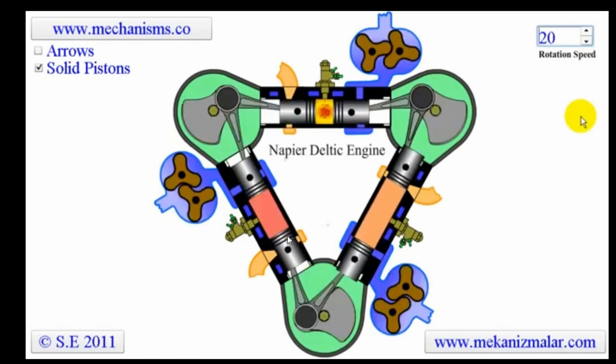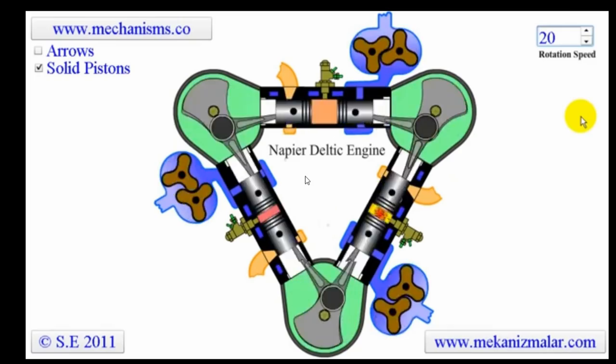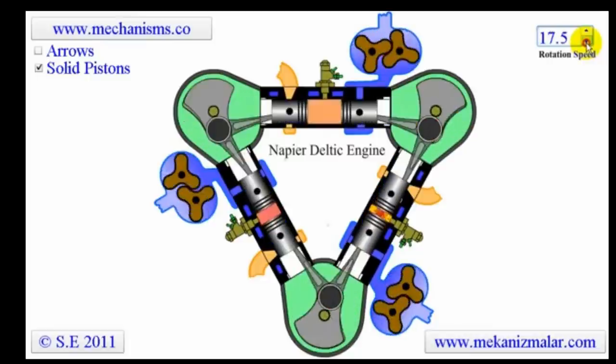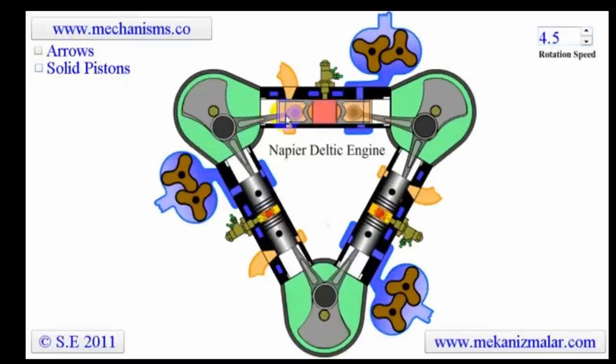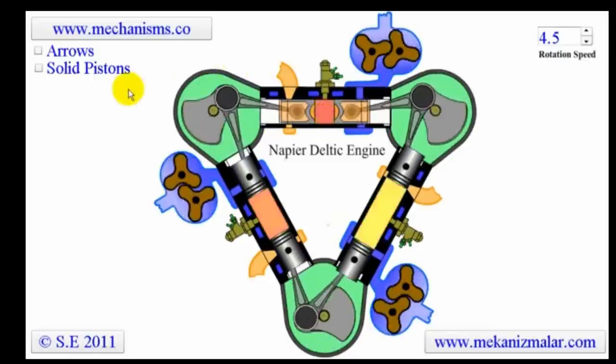You have one cylinder and you have a piston at either end. You've got no cylinder head. And you have in this, it's like a Bishop sleeve, where basically you have ports, a bit like the transfer ports or boost ports on a two-stroke. And generally these engines, well, they are two-stroke engines. Every time the pistons come together, you get an ignition event, boom, right?